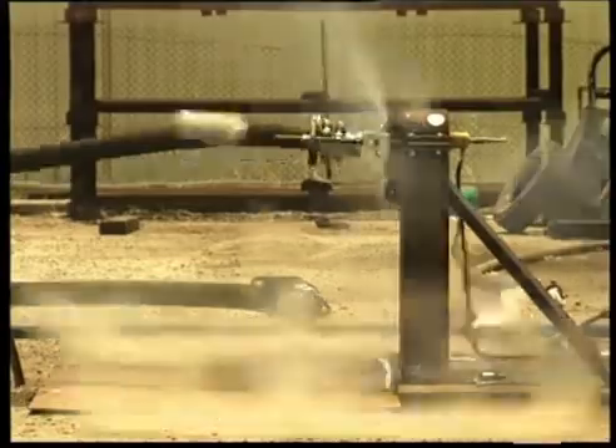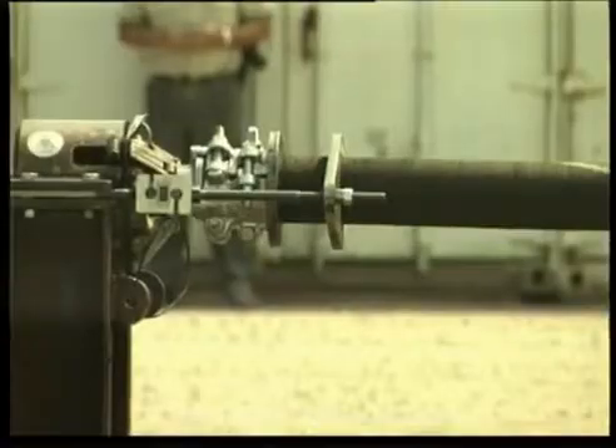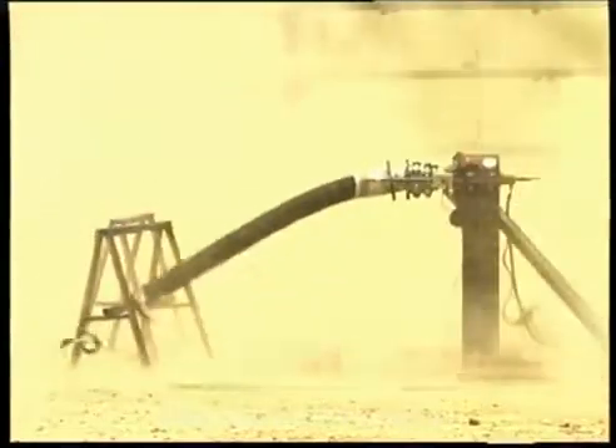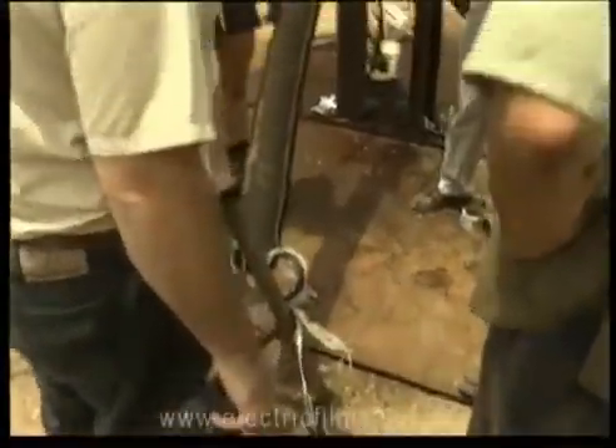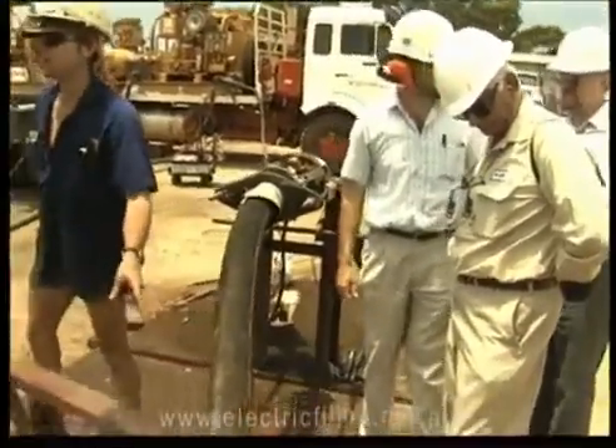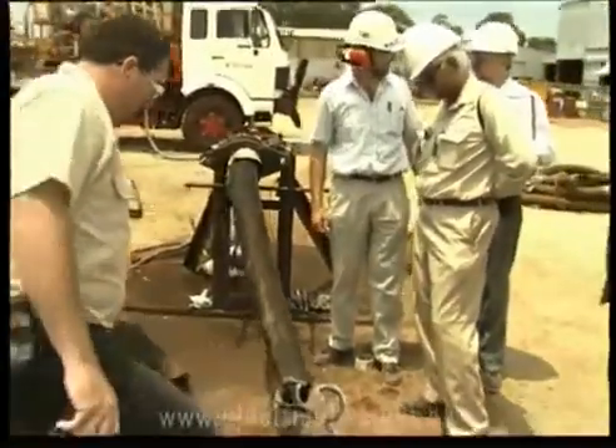This was followed up with force measurements on three-inch and four-inch hoses at 350 psi. During one of these tests, however, the four-inch hose failed. This was particularly interesting because the hose burst at a pressure well below that which was quoted by the manufacturer. The hose was brand new and in undamaged condition.